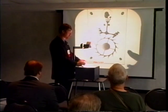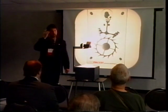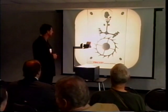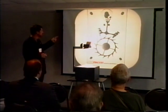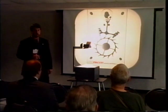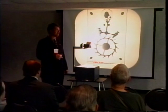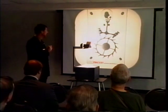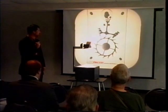How many watches have those nice adjustable pallets? None. Yeah, that's too bad, isn't it? Now, you notice I've got my one-third total lock set, and I try to go through the impulse to drop to total lock to the opposite side, and we got a problem here.